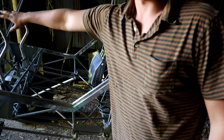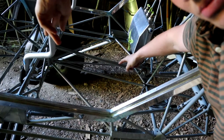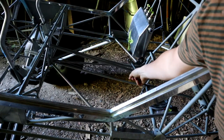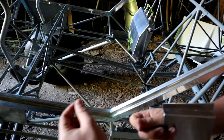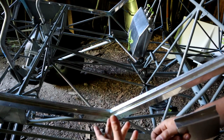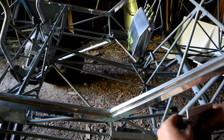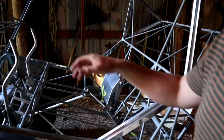My rod ends finally came in and I got my elevator actually hooked up, though it does have an issue. The push-pull tube, when it comes back, makes contact with the top of the seat belt. The flight control system is controlled by rods with rod ends on the end — there are 19 of them. Those rod ends can be tightened and loosened on threads to extend and contract. The manual says to bring this one out half an inch, but if you do that it makes contact with the seat belt tab. So I'm going to shorten that one and extend the second rod end instead — and just like that, problem solved.